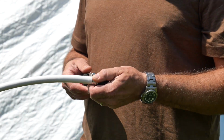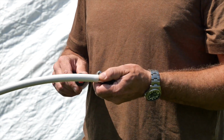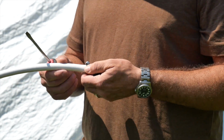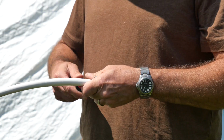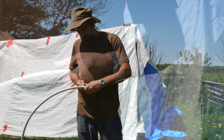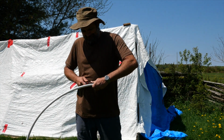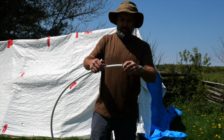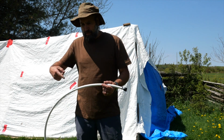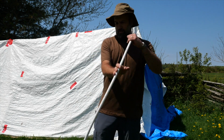I don't care. We might do our house with PEX pipe, and at which point I will buy a proper kit, crimper and all that fun stuff. But for now, just heat it up, push the fitting in, and I'm just using a ring clamp and tightening the ring clamp. There. I think on the intake side, it's not under a ton of pressure. So I don't think it's quite as critical as, say, on the output side, where the pump is creating pressure within the hose and it's more likely to leak. This is just sucking in water.